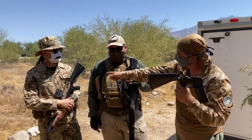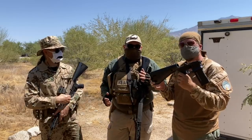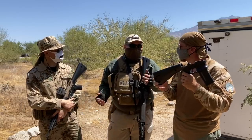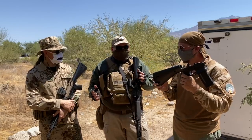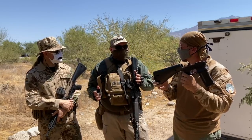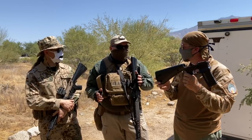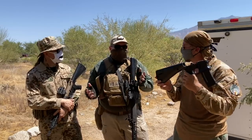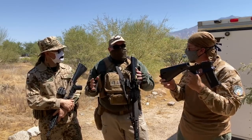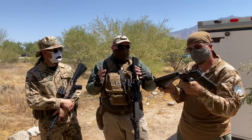So this is a different polymer blend that Ian's holding? Yes. They're both 30% glass filled nylon, but they're different brands and have slightly different properties. So we found that the second one, that we ran numbers 21 through 50 with, molded the best, welded the best, and had the least amount of warp coming out of the mold. Warp happens because the parts have to cool, and as they cool, the thicker parts can shrink in, and you accommodate for that in your mold design.